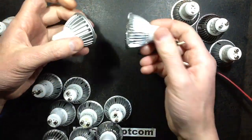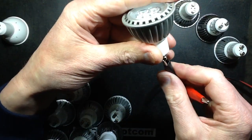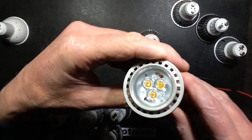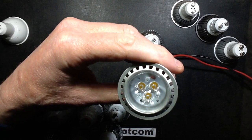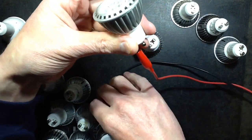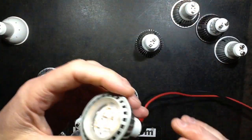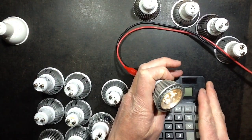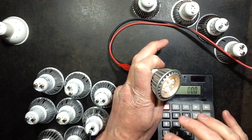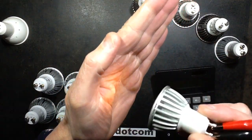From the same place as the hydroponic one, so I'm guessing similar circuitry — this is a warm white one, very stylish. I like this one; it's got an interesting retaining system that will be covered in another video. This one on 12 volts, getting the polarity right, lights quite brightly — actually a useful amount of light. These lamps are only drawing about 9 milliamps, so that's 12 volts x 0.009 = about 0.1 watts. It's not that much, but you could easily read by that.